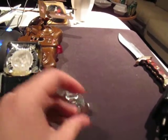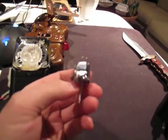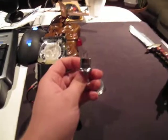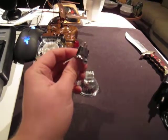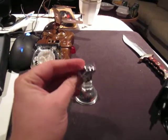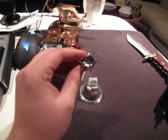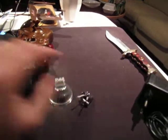Looking around it, I found that I could unscrew the back part, which reveals a tiny circuit board. This circuit board serves two purposes: one, it's the rectifier for the AC current, and the second is that it's the driver for the LED unit. Without it, the LEDs will draw a massive amount of current and it would damage them. So leave that one in if you want to do this hack.